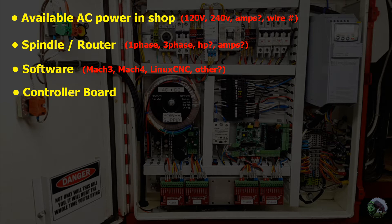That leads us to the controller board. In my research, it sort of came down to two major contenders: PMDX and ESS, which is Ethernet Smoothstepper. Those were the main ones I was looking at, mostly because those manufacturers provided drivers and plug-ins to work with Mach 4, which I was interested in using. Bottom line is you need to decide on the software and the controller board at the same time — you have to pick a combination that's proven to work together, otherwise you're going to walk that road alone, and that's going to be harder.